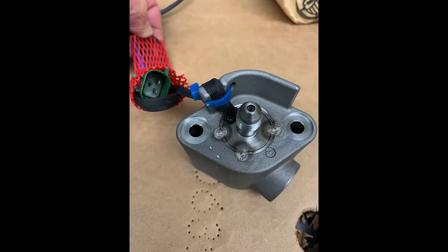Welcome back. We're looking at the ISX-871 after-treatment injector, also called the number 7 injector by some people. Cummins calls it the doser injector or the dosing unit. It's bolted on with two bolts onto a cast iron flange that bolts to the back of the turbocharger turbine housing, which is the exhaust housing.